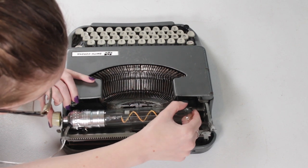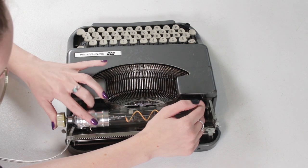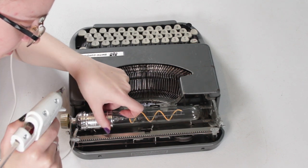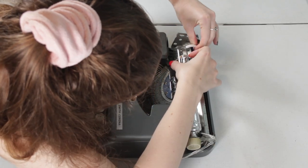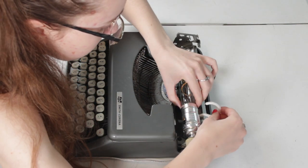What I ended up doing was taking the left-side platen knob piece — which has a little metal tail that would go into the platen — and fishing that through the platen knob hole on the right side so the metal tail was sticking out. Then I used hot glue to attach the base of the lamp to that hole on the side, so it was anchored. I used hot glue specifically because it's removable, so if I ever need to take something else out of this parts machine, I still can. I let the hot glue sit overnight, but then realized the lamp was just a little too heavy for that single anchor point — I needed something to lift up the light bulb on the left side. I tried ordering curtain rod hooks off Amazon that would be big enough to hoist the bulb, but they were not the right size and I couldn't find a way to anchor them to the typewriter.